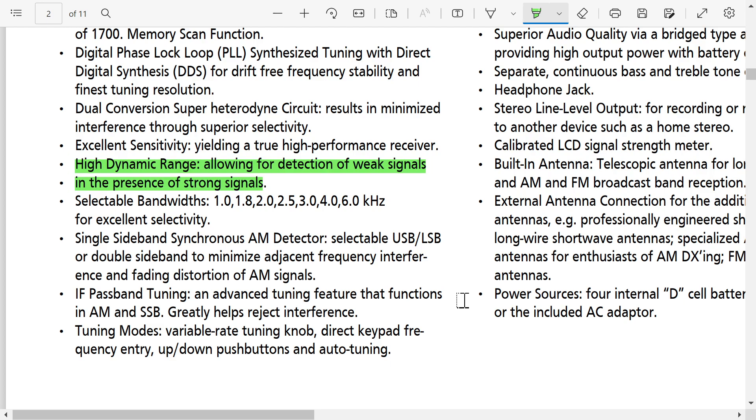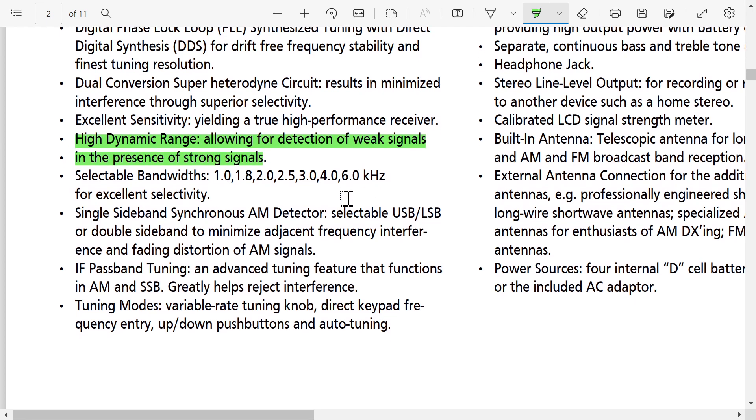Some will probably be unhappy not to have a 9 kHz filter on AM for better mediumwave reception and higher frequency response. Synchronous AM detector with selectable upper/lower sideband — we'll see how well this works. I'm not a big fan of this feature for one simple reason: you can achieve the same thing by tuning upper or lower sideband on an AM signal. The synchronous detector just locks on it automatically, making it easier.